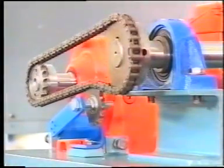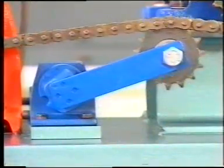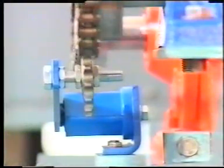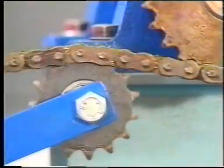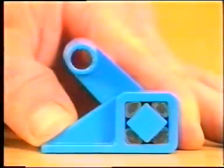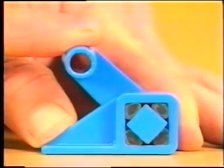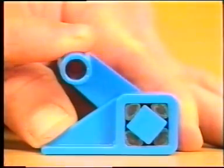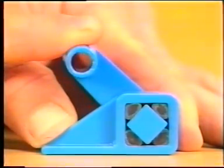In principle, the device operates via rubber suspension elements housed within the frame. A swinging arm, which supports the slack side of the chain, is mounted in such a way that any deflection via the chain causes it to twist within the rubber elements, which in turn dampen or provide a torsional resistance to the movement.